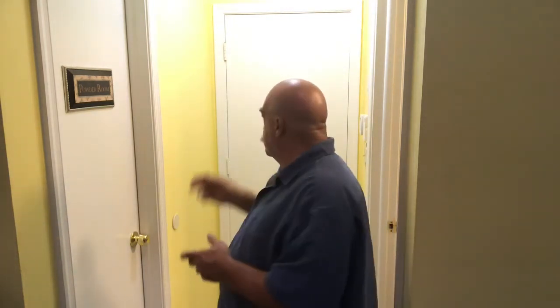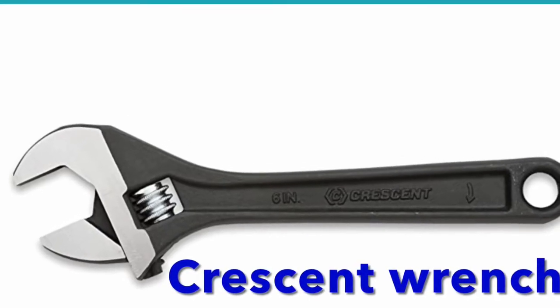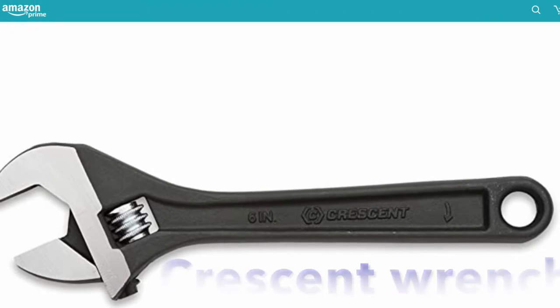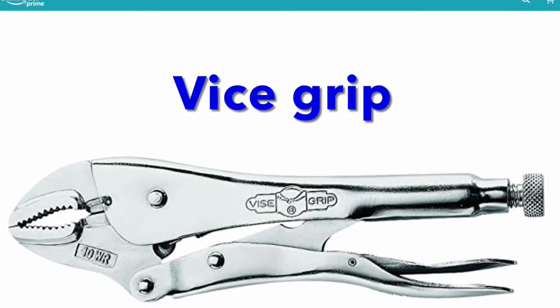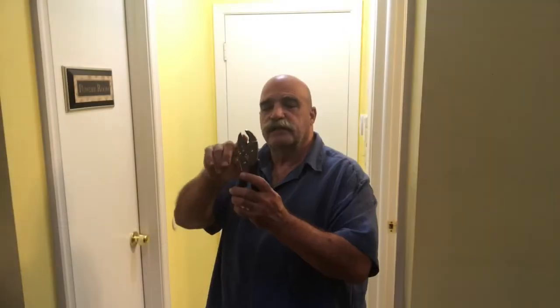I'm going to have it down in the description. If you don't have that tool or don't want to buy it, a crescent wrench will work. You'll use it just like the knuckle bender. Or I have a third option, a pair of vice grips, a rounded type. I can put it on there and squeeze it and bend what I need to do. So now I'm gonna show you how to do it with the vice grips.